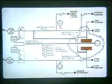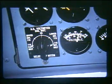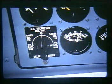The metering circuit in the Group 2 aircraft is basically the same as Group 1, with the exception that the captain's and first officer's instrument voltage is now 115 volt AC instead of 26 volts AC. The only 26 volt AC used is for the engine instruments. The AC selector switch and associated AC meter are located on the generator panel in the same location as in the Group 1 aircraft.